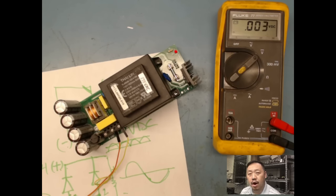Same thing with your analog, your op amps. Op amps are really difficult to check. The reason why is that without any schematic, you won't know what the circuit is like. So you don't know what the gain is, what the op amp is designed for. Is it a comparator? Is it like a 10,000 gain, 1,100 gain? You don't know. So what we do here is we basically just inject the signal in and see if we get any kind of change on the output. And whenever there's any question, we replace it because they're fairly cheap. So that's kind of the steps that we go through to troubleshoot boards without any schematic.